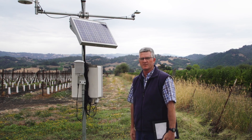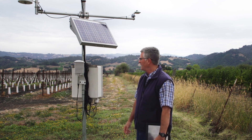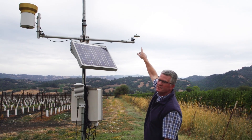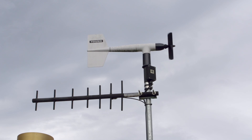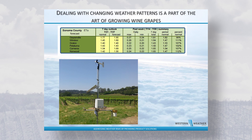This is one of our stations located here in the Alexander Valley. It has a full suite of instruments on it — air temperature and relative humidity powered by a solar panel, solar radiation collected up here, and a rain gauge. Everything is done via telemetry with the wind sensor at the top and beamed out and available on the web. Weather stations provide reference evapotranspiration, also called ETO, measurements for irrigation scheduling.